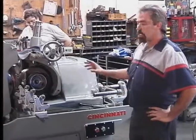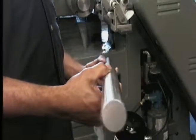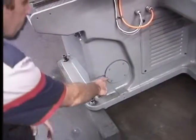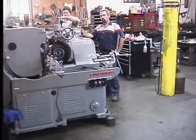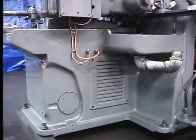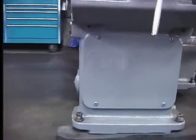The best thing about this is there's no vibration. Vibration is a killer when it comes to grinders — it affects your part, it affects the finish. It's a big deal. What causes vibration? Vibration is transferred through the gearbox, through the intermediate shaft, through the clutch, up through the chain, into the idler, and finally to the feed wheel itself. If you've eliminated all of this, you've eliminated 90% of vibration. So what little is left is essentially non-existent.